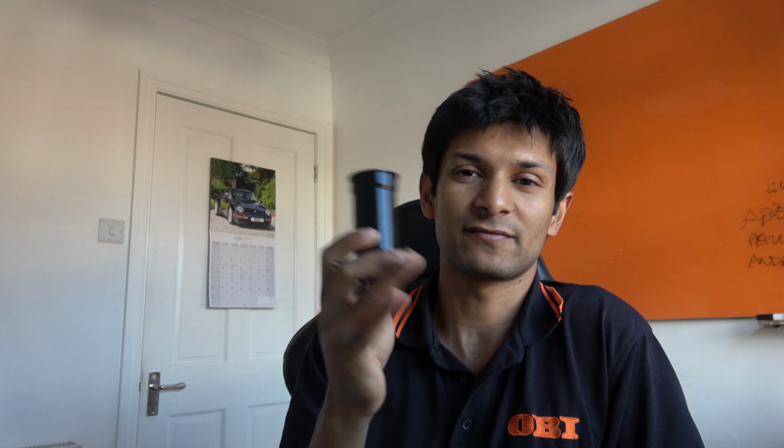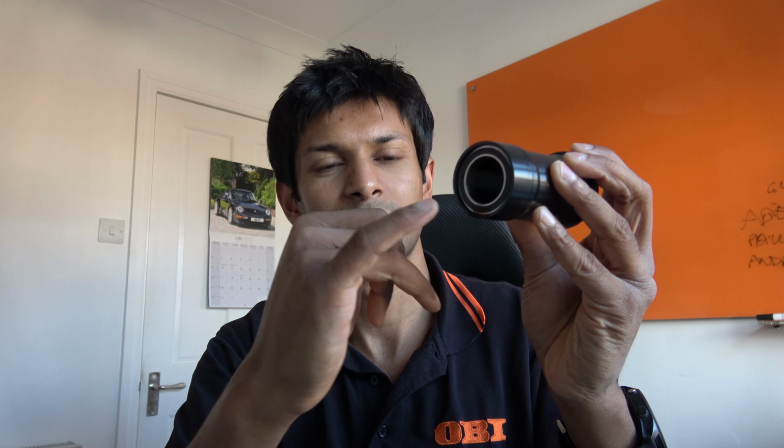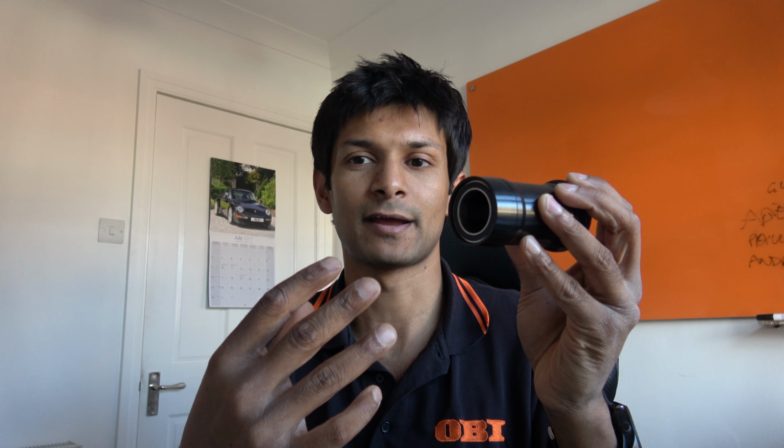The reason why these are stiffer, even the standard one, than the BB Infinite is the guys who made BB Infinite made a conscious decision in their bearing placement: they don't have full retention on the bearings. So if I explain what that means, if we've got this bottom bracket, the bearing sits completely in the bottom bracket. There's metal all the way around it.